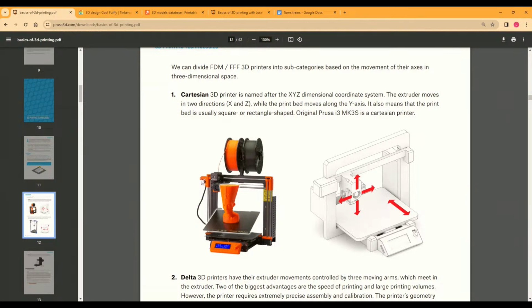And the models, there's less to design around because it's just an easy flow. But it also doesn't have the best material properties. So if you're doing something functional or something for outside, ABS is wonderful because it has better impact strength. It's UV stable, so it doesn't get brittle from the sunlight. So things like that. And that's where learning the different material types and plastics will help in your design.